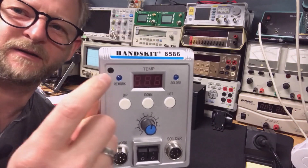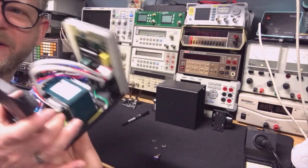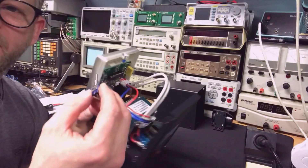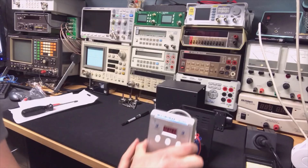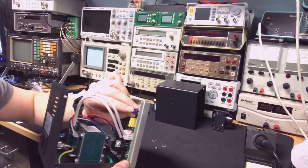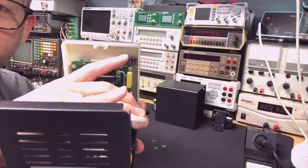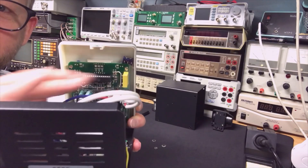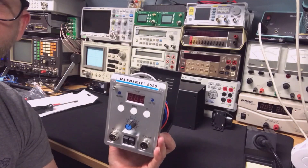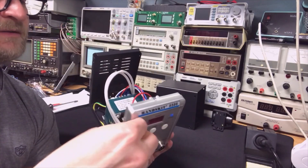To make it look good in the front, the ring or washer I have needs to be in exactly this position. But then it is very close to the board, so my switch can only go horizontal - and you switch it on and off horizontal which is just super ugly. There is no space to put it vertical but I want that. So I'll try to cut something from the PCB if there is no trace there, because it should go up and down, not left to right. So I will take out the board and break the seal - there is a hole there anyway so it doesn't matter.